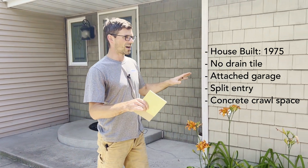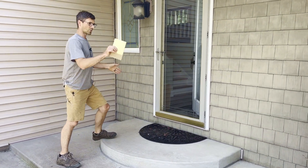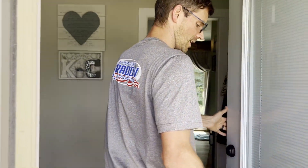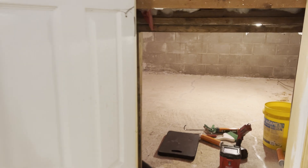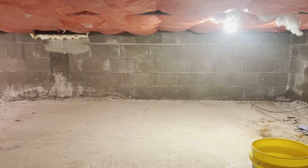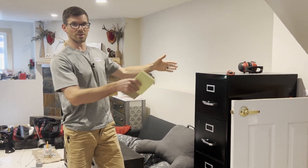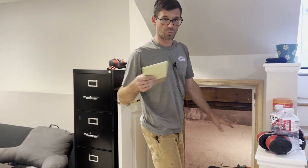Two of the guys that answered want to know how do we choose the spot for our initial suction point. Just a little context: this house was built in 1975, does not have drain tile. We've got an attached garage here, and a front step area that probably has its own foundation zone — these two could be potential spots that we might need to mitigate, but probably not very likely. It's a split entry. There's a crawl space with a concrete floor under this entryway here. That far side is going to be the common wall with the garage. Our radon fan is going to be in the garage attic, so we've got a pipe going out that wall. There's a block wall that comes up to about this height separating the crawl space from the rest of the house, so we're going to have a footing there. For the initial suction point, it's got to be somewhere in this crawl space — we'll probably end up with some more here.